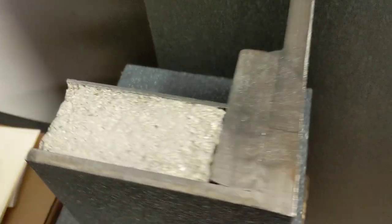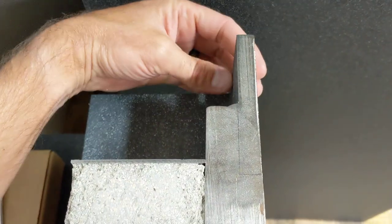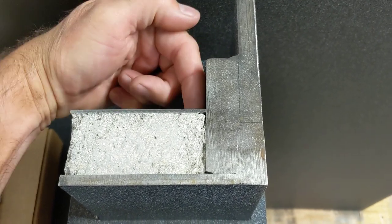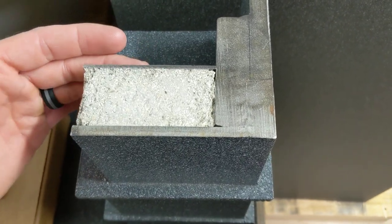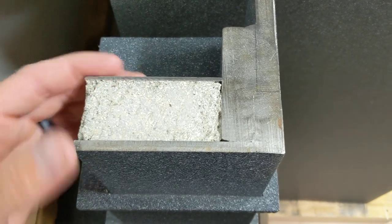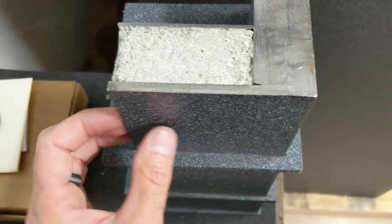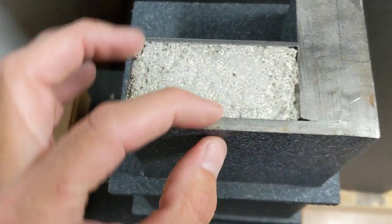This is a cross-section of this safe, looking at the door from the top down on the corner. This would be a half-inch plate and then a three-quarter-inch piece here — that's where your locking bolts extend behind, into that solid three-quarter-inch plate. Then you've got an 11-gauge body here; it's 10-gauge on the taller safe, but this one is 60 inches tall so you get an 11-gauge liner. Then an inch and a half of concrete — or proprietary material that sets up like concrete. Your fire rating with that is 1,750 degrees for one hour. And then a quarter-inch body.